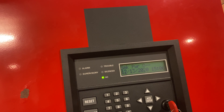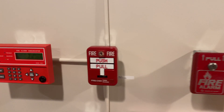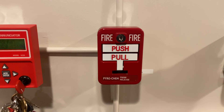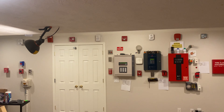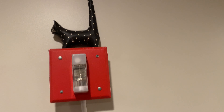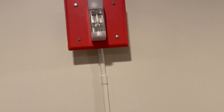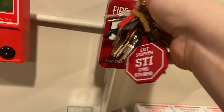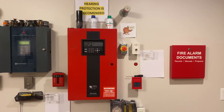We'll go ahead and put a reset, then come over and do the Pyrochem 551167 and do some controls from the annunciator. Alright, here we go. We'll do silence from the annunciator — you can see that it's flashing away. Trying to find my Cat15 key — there it is. Go ahead and reset this, then go ahead and reset with the passcode. The panel is resetting.